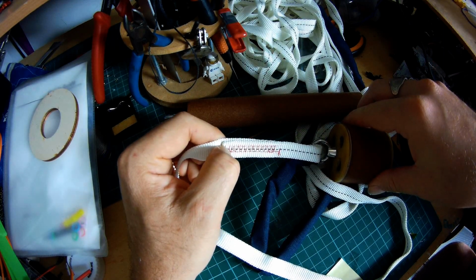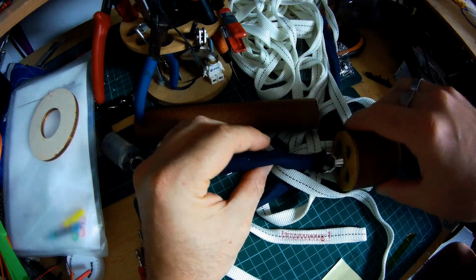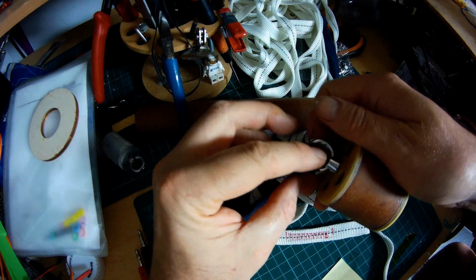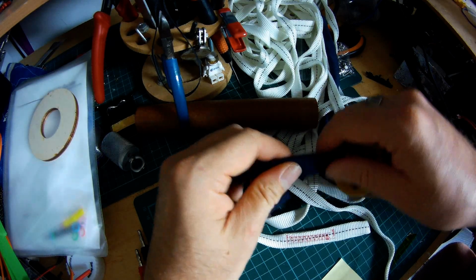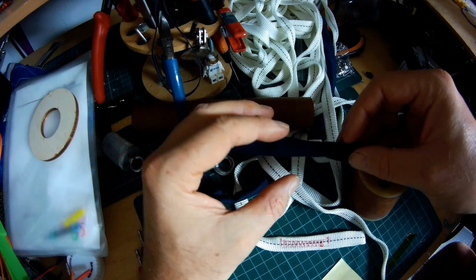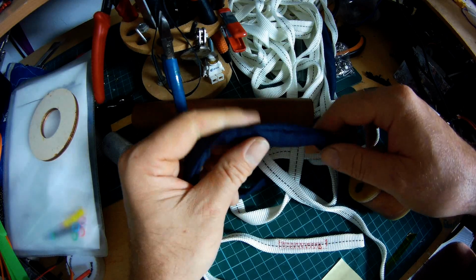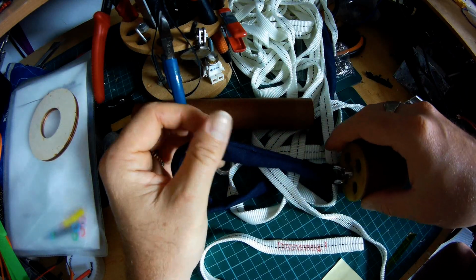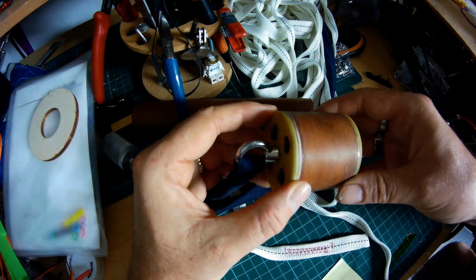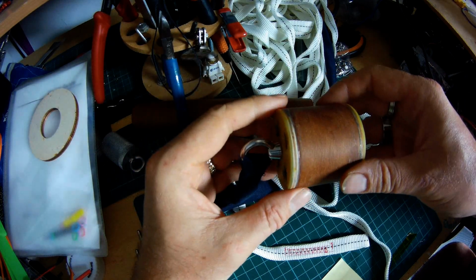So stitched into a loop through the lifting eye, and then I've covered the lifting eye with Nomex. So I've stitched a thin tube of Nomex together. I left a little bit to cover up this end bit, and basically that's some fire retardant cloth that this tube extends about 30 centimeters up the main piece of webbing, and just makes it a little bit more resistant to fire. So yeah, that's how we're doing the baffles on the ODR rocket and on some of the other stuff.